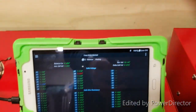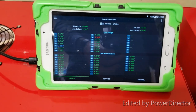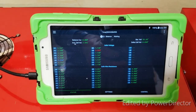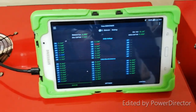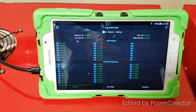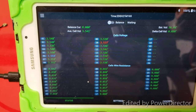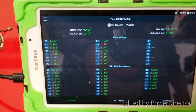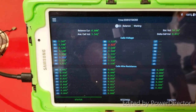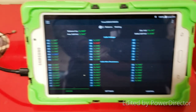Well, the battery is on float right now. The other 2 Powerwalls are turned off. And let's say you have only one Powerwall and you do want to shut it down. So it's already on float. What can I do to raise the voltage of that one cell? Let's just pretend in this case that there's many amp hours difference between these. We can introduce an outside power source directly to an offending module in my Powerwall. I'm pretty sure you guys want to see that, so let's demonstrate that.